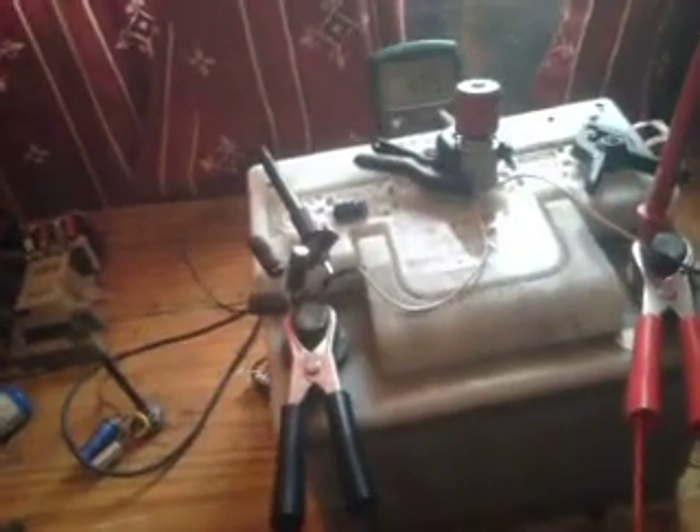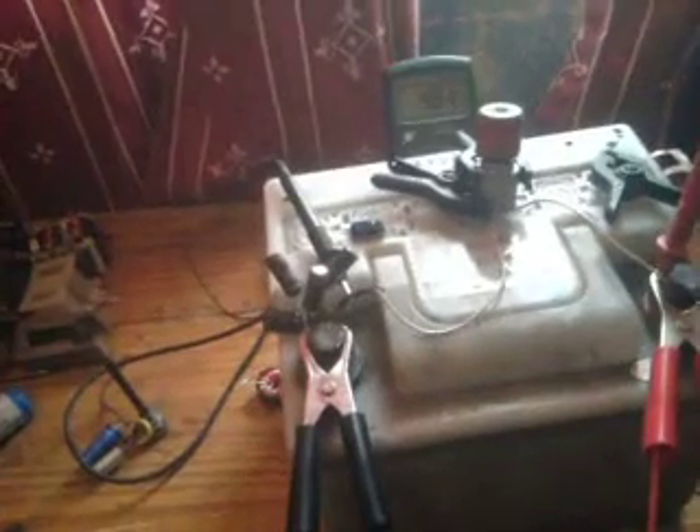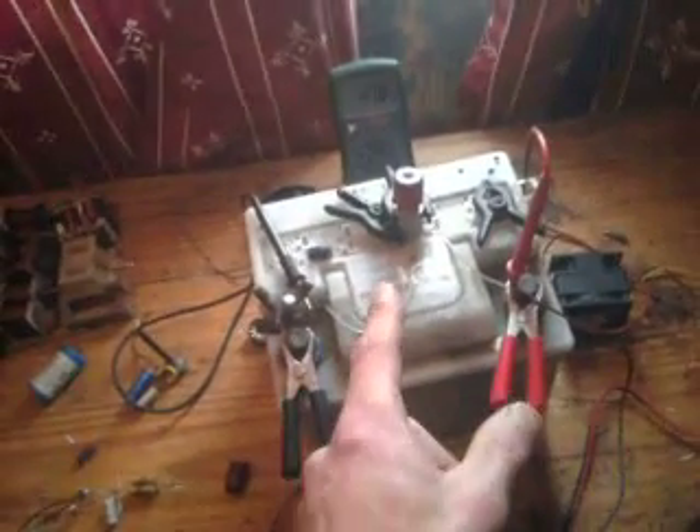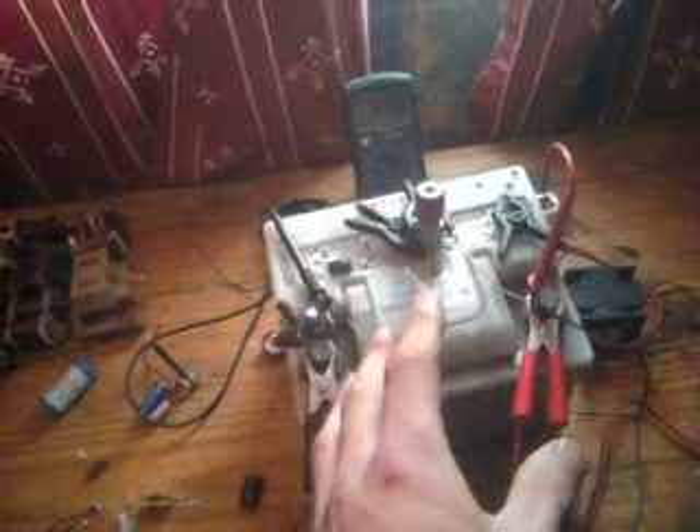It's quite an adaptive circuit — very adaptive. In a high current load you'll need a higher UF. I actually tried that with this one — a 16 volt 2,700 microfarad capacitor — and it didn't really want to know. It ran the motor, but very slowly, due to its internal resistance. I did try these ones on this motor, and the 16 volt 1,000 microfarad cap got hot because it's holding back the current, but this one was demanding more current.